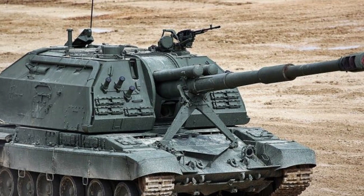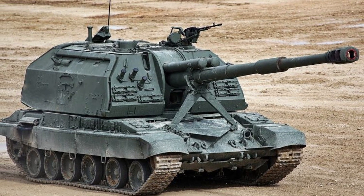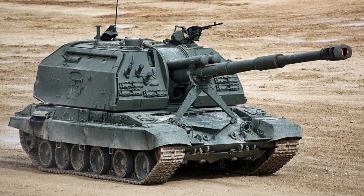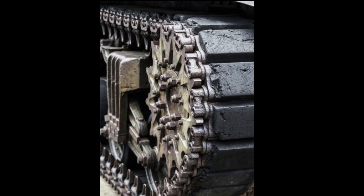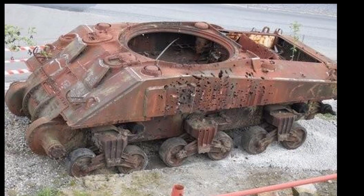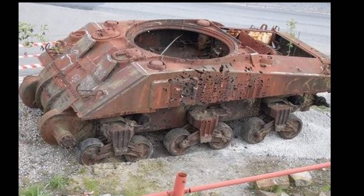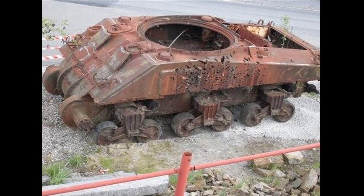The location of the pin heads outward or inward depends on the type of machine. On tanks, the caterpillar is fitted with the pin heads facing the body. In the direction of movement, rebound fists are installed on the side of the tank, usually at the rear. During movement, pins crawling out of the track shoes hit the fist and are hammered back into place.